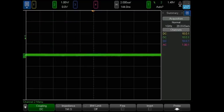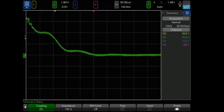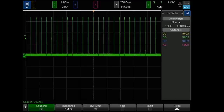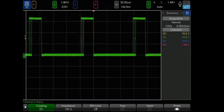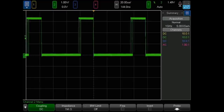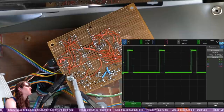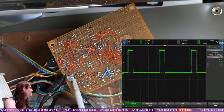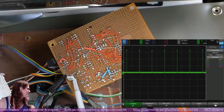Let's go to open loop mode. Whoa. So we got some ringing, but it's a much more manageable frequency now. And it doesn't extend past the power supply rails by a worrying amount. It's already crashed though. So far, so good. Oh, that's a crash. Looks like the servo loop is still running, though. That's interesting, right? I wonder if there's also a software bug component of this. It feels like we keep making improvements that are not actually fixing the problem.